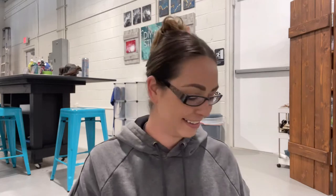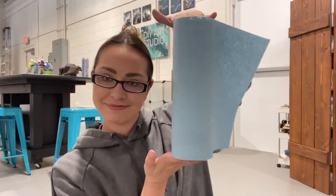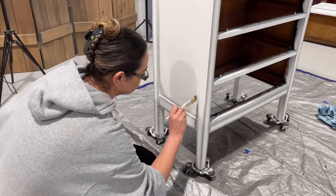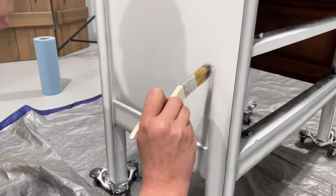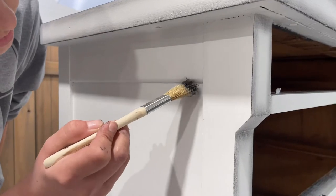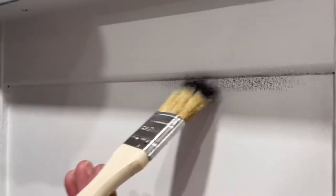Next is dry brushing. You're going to need chip brushes, one inch to three inches, your black paint — I'm using Paint Couture in Baltic black — and last but not least, a whole roll of shop towels. Dry brushing is a really easy concept. You just get a little bit of paint on your brush and use a shop towel to wipe away as much as you can, then very carefully go in. I'm doing the edging on the whole project here. You can dry brush the whole piece if you want — there are a lot of different things you can do with dry brushing. If you take a look in my channel under the Extreme Buffet Makeover, I do an extensive detail on how I do all this edging with the dry brush technique.